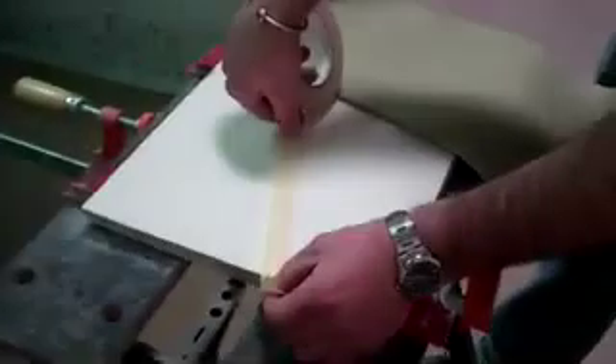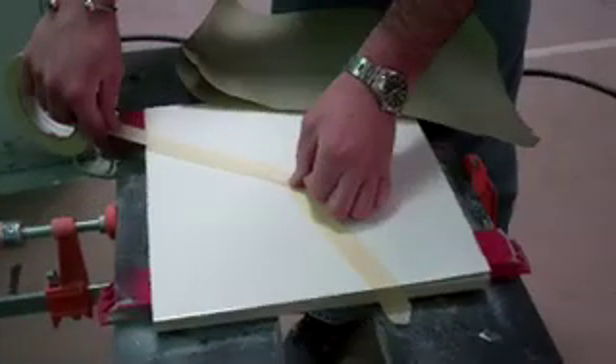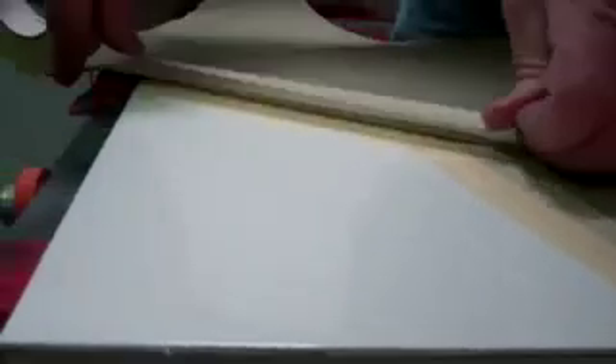The repaired area is smooth and shiny. Even though it is smooth and shiny, it's necessary to sand and polish. Mask off the areas that were not repaired and then begin sanding. Sanding opens up the surface, allows any solvent to escape, and allows for full cure. So even if the surface looks smooth and shiny and acceptable, it's still necessary to sand the area that was coated with the blended Duratec and gel coat.